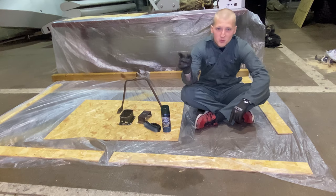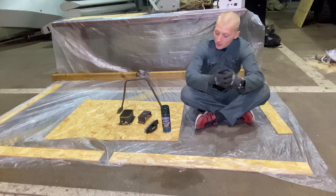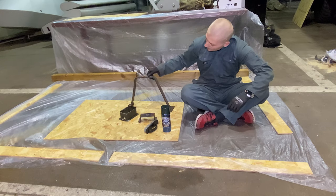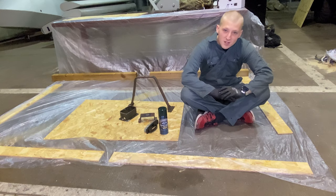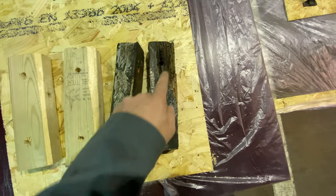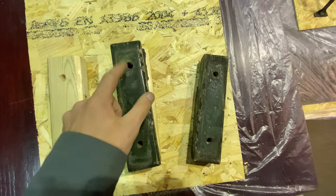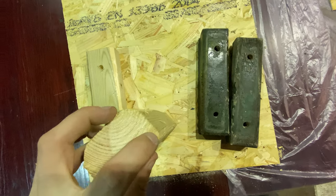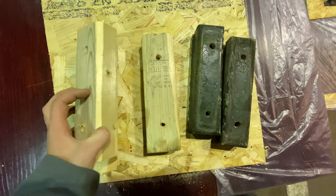Now that most of the roof is done, I'm going to sort the right-hand side rotten wood and use a wire brush to rub down all the component parts on top of the roof — the bell housing that holds the rope, the blue lights housing, and the bell housing itself. I'm going to rub it back down to bare metal and then use some Hammerite in dark green — not the original colour, but I'm going to re-spray it to give it a nice finish before reinstalling. I also need to replace the ladder supports for the roof. As you can see, particularly this one, they're pretty much rotten all the way through. I've measured them out on some other bits of wood, pre-drilled the holes, and used a chisel on the edges just to take off some of the sharpness of the corners to better match the originals.